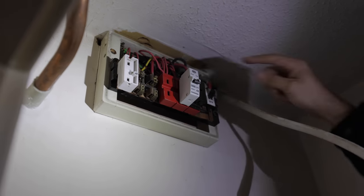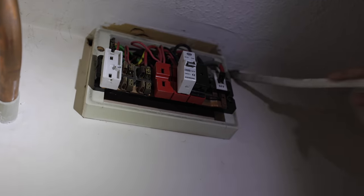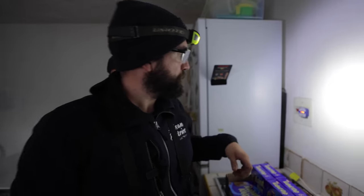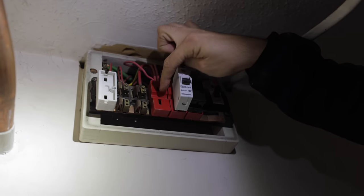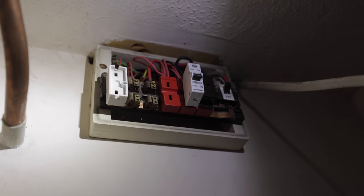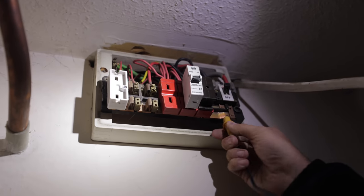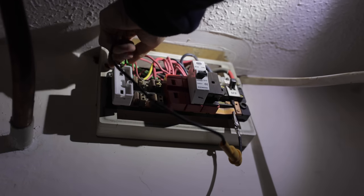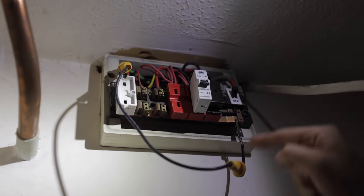We're going to start by identifying our circuits - we've got everything off at the minute. The only circuit I've got on is this one here, which we believe will be a cooker circuit because this was a shower that's burnt out. To link out: you can either take the carrier out and there's a little screw here which takes this off, then you put your shorting lead from here to the bar, or you can link the whole bar out onto the bar. Anything that's switched on is effectively linked out, but you must make sure that is removed after because if you knock that on you've got a dead short across live and earth.